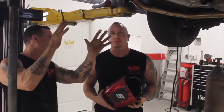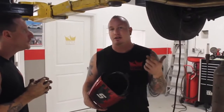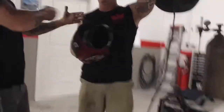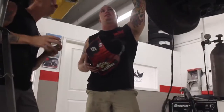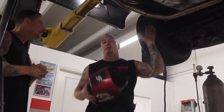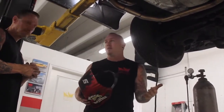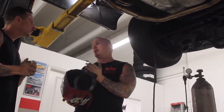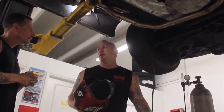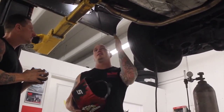You also mentioned 304 stainless. What is the difference between the metals? There's steel, there's aluminized steel, there's stainless steel, there's 304, and there's 409 — each one is a different material. I went with 304, which matches the previously built header pipe, so the system will match front to rear. All of that changes not only the life of the product — whether it's one to three years, three to five, five to nine, or ten-plus — but also changes what the welder does in terms of heat, wire feed, wire speed, and wire thickness. Everything changes depending on the size and type of pipe you are welding.